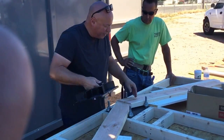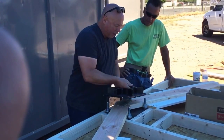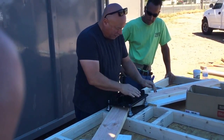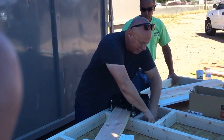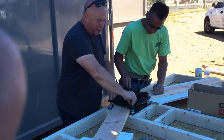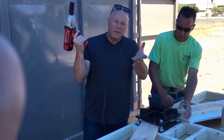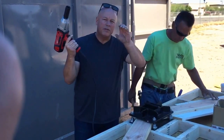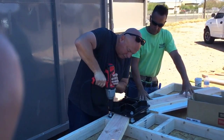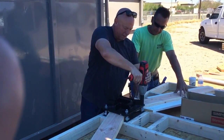When we put this together, we got one plate under there already, and we're going to put another plate up top. Then we put this on top, and all we're going to do is take a simple impact wrench and impact these, compressing them together to press those plates into our truss. We're going to cross the pattern back and forth.